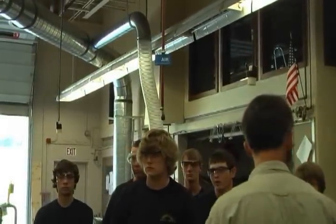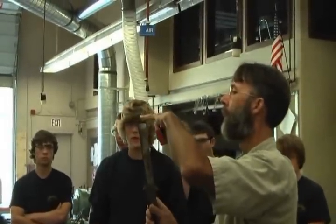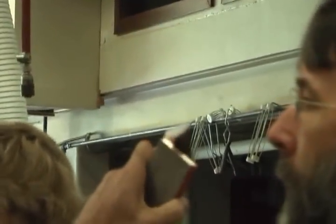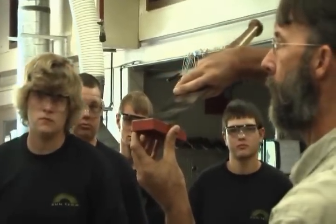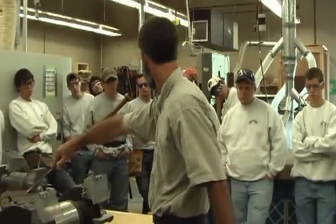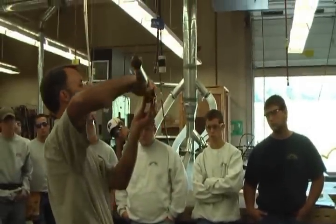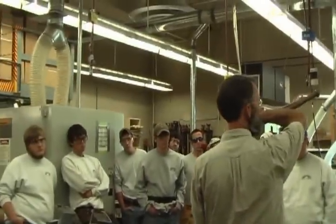Now the reason for the hollow grind is to give us a reference. We've got the hollow, and we've got this edge. This edge and this edge are going to give us a reference, and I can feel it when that touches. If this is ground perfectly flat, if I take this to the local belt sander and I just go like that, I get more or less a flat surface, but I can't rock this and feel when it touches. That's the purpose of our hollow. Okay?